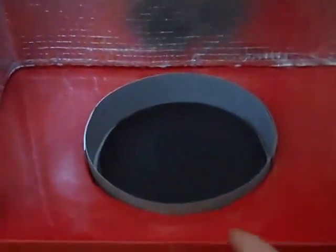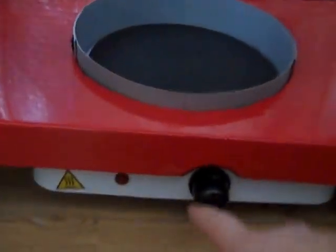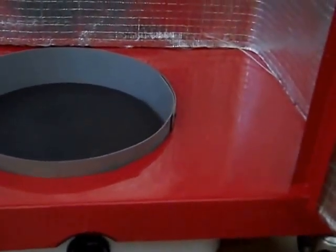Here's the final cabinet. It's just a tool cabinet that's been covered on the inside with this reflective heat shield material. We've made a steel tube, and the hot plate is in the middle there. We just had to make a small cutout around the temperature knob, and basically that's it. We're going to switch it on and see what temperatures we can get to inside. This actually fits the MGB wheel, which is what it was bought for — for powder coating the wheels.